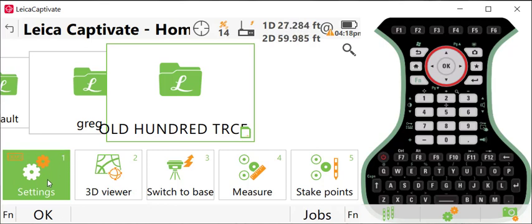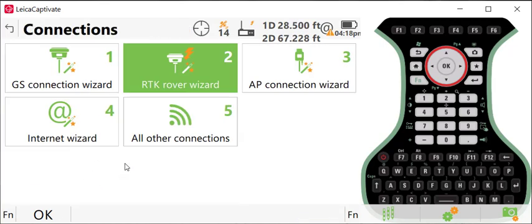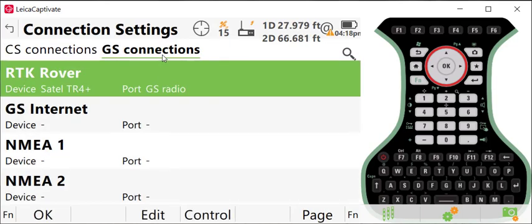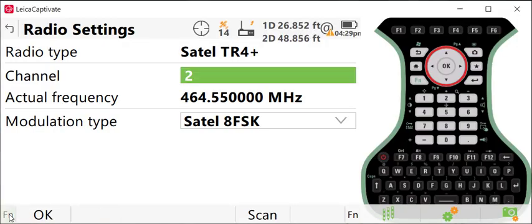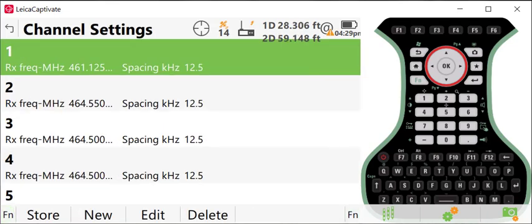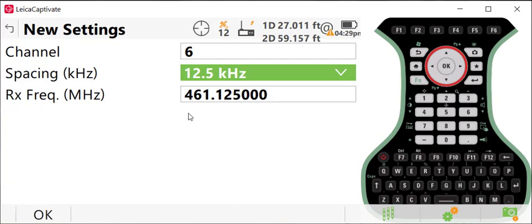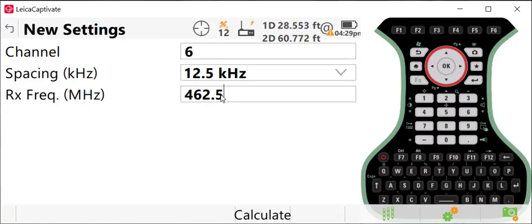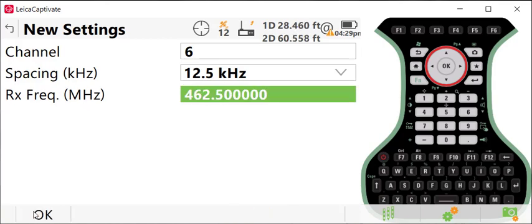We'll go to Settings, Connections, All Other Connections, and then we'll select GS Connections, and we'll press Control. From here, we would press Function and then Settings, and that will take us to our channel list. To create a new channel, we would press New, put in the next available number on the channel, select your spacing, and then we'll program in our frequency. So in this case, we'll say 462.50, and we'll press OK.